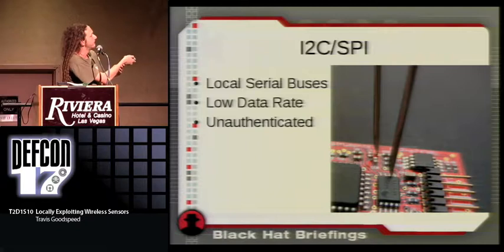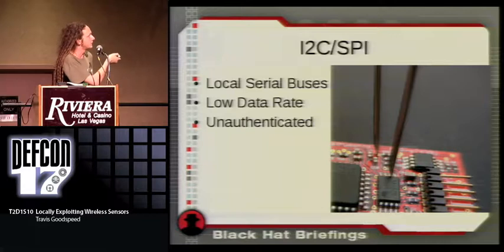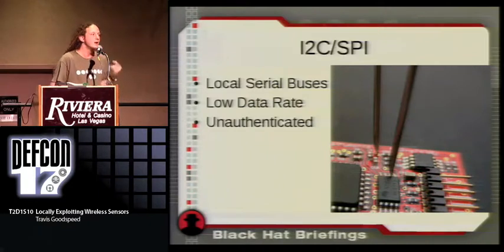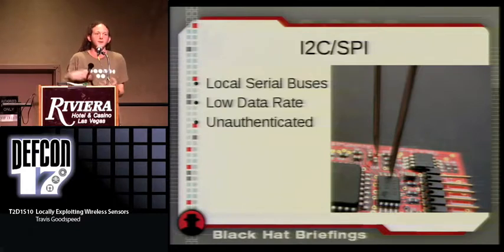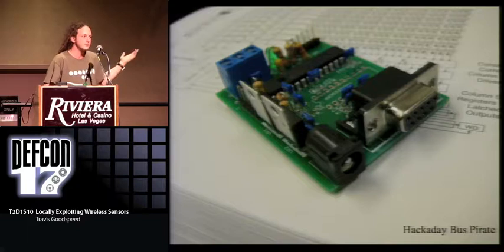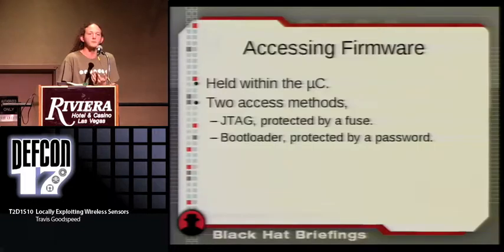Here I have an I2C EEPROM and a USB-to-serial chip reading it. These two syringes carry an I2C signal — one does data, one does clock. Not only can I watch the USB-to-serial chip boot from the EEPROM, but I can also dump out the contents of the EEPROM by speaking to it while the USB-to-serial chip is busy. There's even collision avoidance so I don't have to worry if it's booting at the same time I dump firmware. You can use the Hackaday Bus Pirate for I2C chips, or the GoodFET project, or commercial devices.